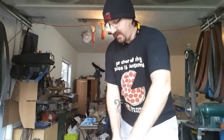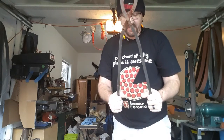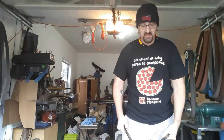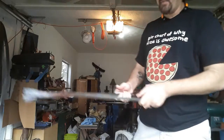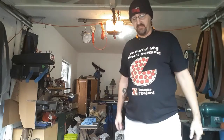So, I'm going to fire the forge, and first thing I'm going to do is get these tongs bent to shape to where they will close around the hammer billet, and I can use it one-handed. Once I can do that, I've got to make sure that I can grab the fire bricks and move those without too much fuss, and then it'll be time to close the mouth of the forge up so I can get this billet yellow hot.